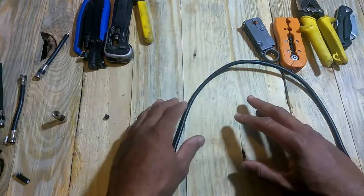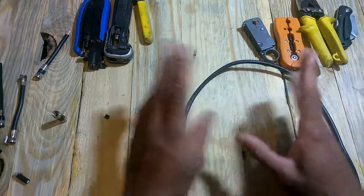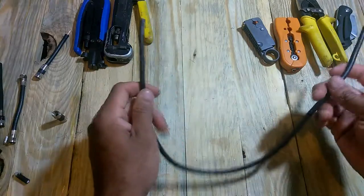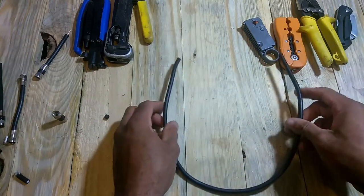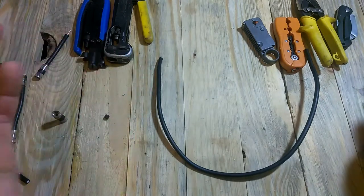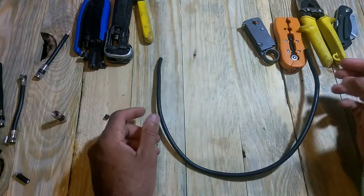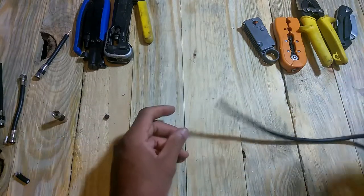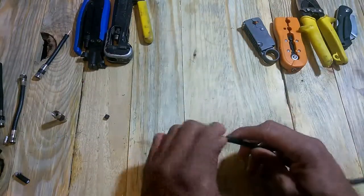Especially if you're mounting an antenna outside, you want to make sure you have the best protection. A tri-shield RG-6 is going to give you a good connection, or dual shield. Or even better, if you manage to find some of that coaxial cord the cable company left in your attic, most likely it's going to be quad shield. So go ahead and use that. Make sure you have the proper cable.